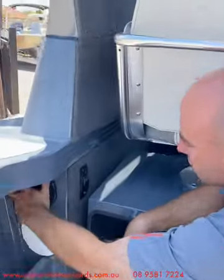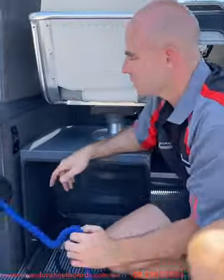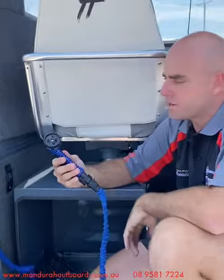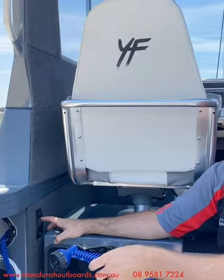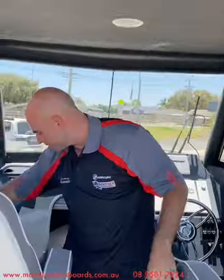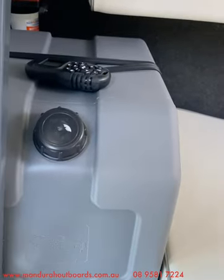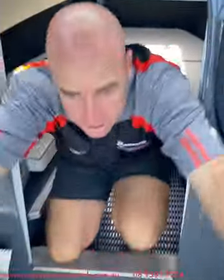While we're down here — the Yellowfin deck wash comes standard from factory, and on this boat we've also added a second hose in white for fresh water, because we've created our own 40-litre fresh water system. There's a slightly different shower head just for the shower since you don't need as much pressure. We've put in a separate switch just for the fresh water system. In the cabin you can see the 40-litre fresh water tank with a fresh water pump inside, which is great for those looking to add fresh water without sacrificing deck space.